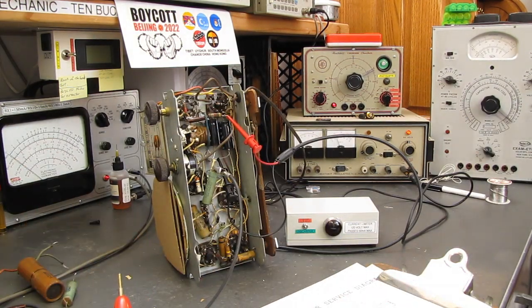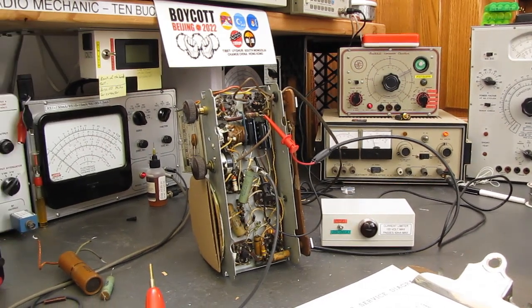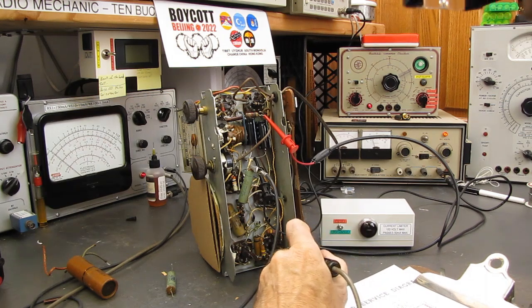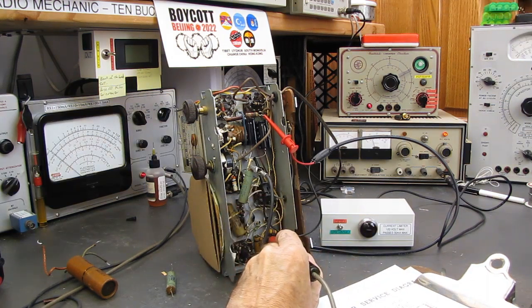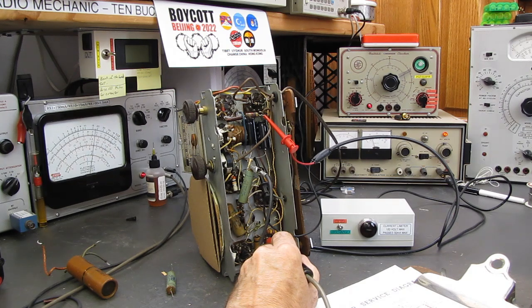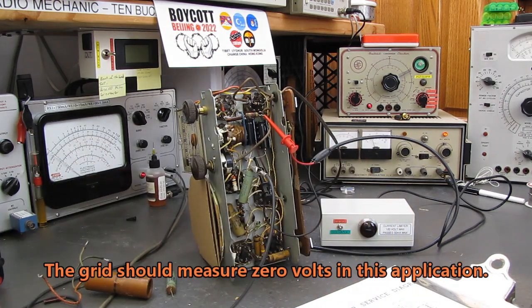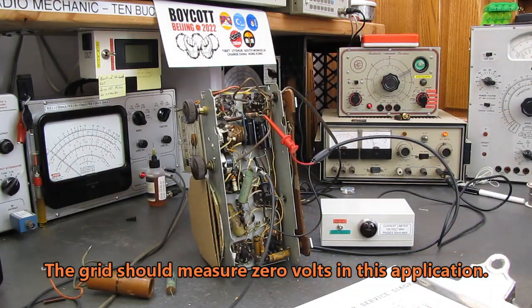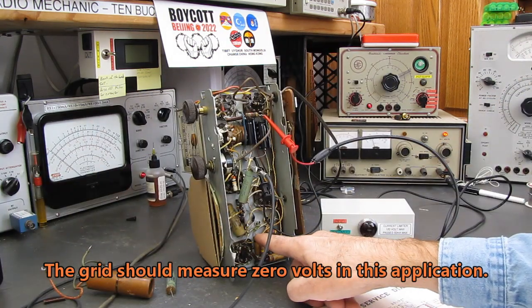And is the VTVM in frame? Yeah, I guess it is. I'm going to go down to pin 5, 1, 2, 3, 4, 5 right here. And we have 9.5, almost 10 volts, 9.5 volts on the grid, driving that tube positive. That is not good. So I'm going to change one more capacitor,